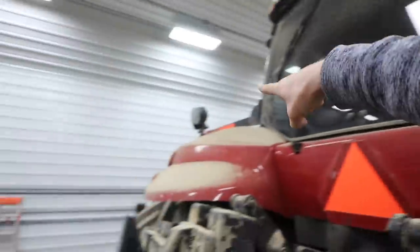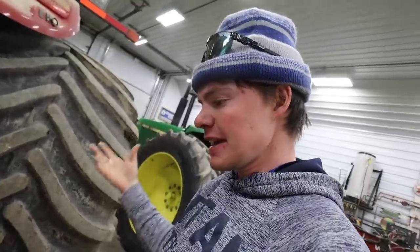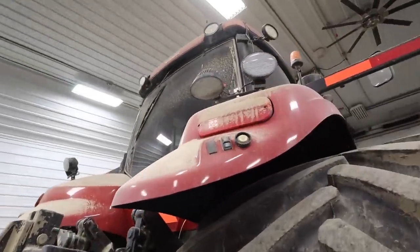And I don't know if Cooper knows or you know, these inside lights on the back fender, whenever we turn those on, it just blows a fuse inside the cab. Just those ones. They're LEDs. We need to put like a relay in there or something. But if you know, that would be appreciated, because it's nice to have those lights. We just have them unplugged right now.